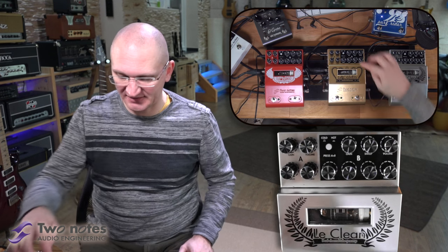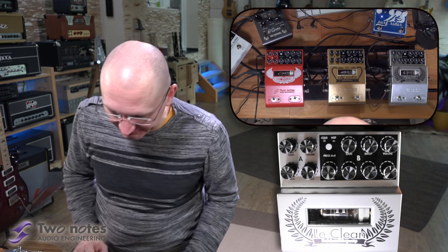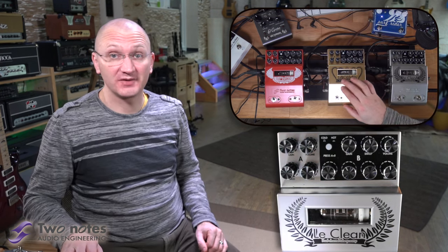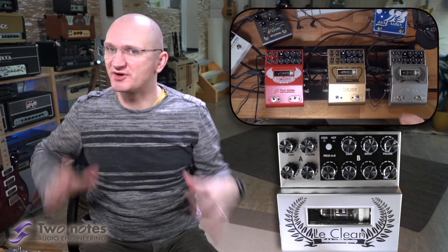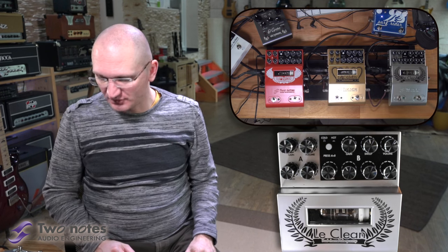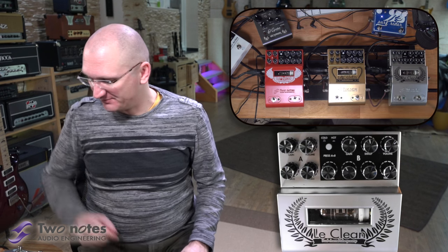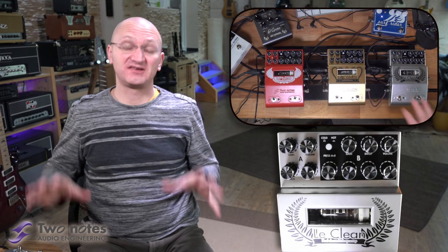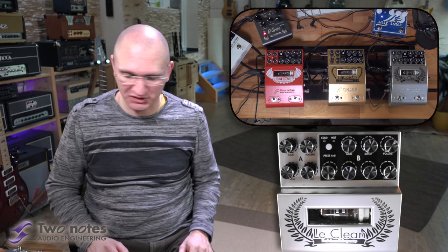Obviously, to access hot and cold, you would still have to use your finger. So it's not 12, it's more like 9. It's a 9-channel thing. But you can access hot and cold settings via MIDI. So if you move these upwards on your pedal board, behind your looper switcher, like an ES8 or GSC4, anything that is MIDI capable, you could literally plug MIDI into the first one, daisy chain them through, and access all the sounds in here. So that would really make it a 12-channel preamp.